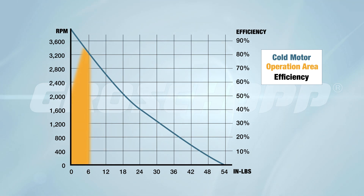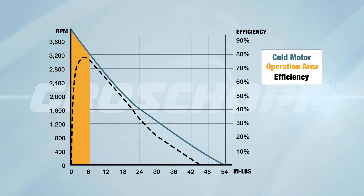Take a look at the gold shaded area on the curve — the motor can be operated anywhere within this area. The key to rating a BLDC motor is torque. This particular design is rated at 6.9 inch-pounds of torque, and like all brushless DC motors, the maximum torque rating is independent of speed. The only limitation is that when the speed is lower than 300 RPM, cogging may occur with the motor. The cogging can be lessened by using a more sophisticated control and feedback system.